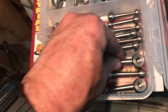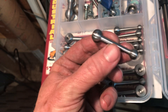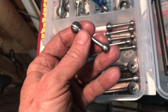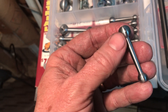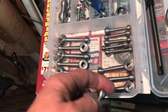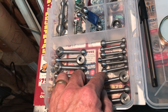Here's a little basket of them — that's how I organize my work. Next up is to do the same process on all the small ball handles. This is the finished blank for the small ball handles. They're two inches long and they'll get faced off at a 20 degree angle, and drilled and tapped for a 10-32. This is a 5/16-24 thread. The British design calls for a BA thread and the 5/16-24 is the closest to it.